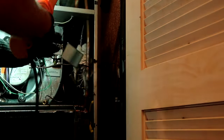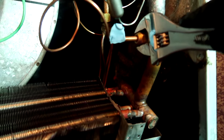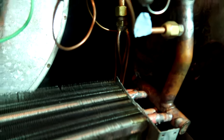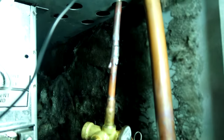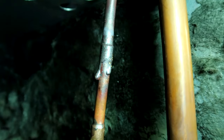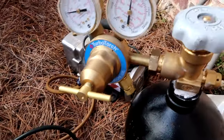That looks good, corner looks good. We got action - let's bolt the old equalizing tube on, just be careful not to kink it. There we go - don't kink this stuff. This is the TXV bulb, we'll put that on here after we pressure test, just make sure none of this is leaking. There's my three-eighth line braze - for all the super techs that like to pick me apart, you got a little boogery here, but I don't try to be perfect when it's all tight and the insulation's burning and smoke alarms are going off.